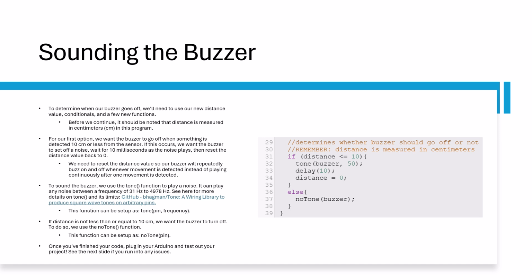For this project, we'll put the tone at 50 Hz, but the buzzer can make any sound between 32 to 4,978 Hz. If you want more details on the tone function and its limits, there's an article in the description for reference. Using the delay function, we'll have the buzzer play for 10 milliseconds. Then, set the distance variable to 0.